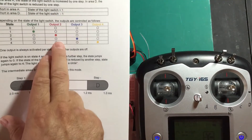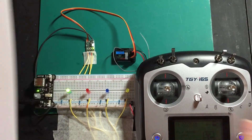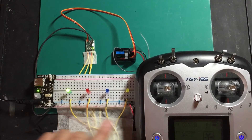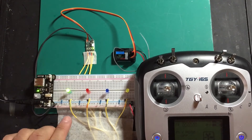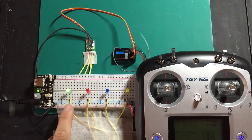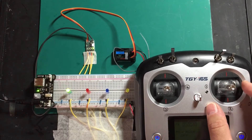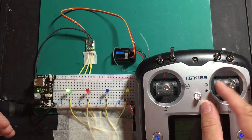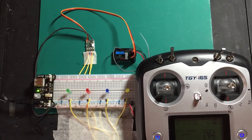As an example: we're in step two, output two — we're in step two, we can go down back to step one. These are LED outputs, but you could use them as negative trigger outputs to trigger other units, whether they be relays or other functions. Maybe not a motor directly, because depending on the load these are limited — I've covered that in the specs video. But certainly you could run this to a relay, like a small triggering nine-volt relay, which could then trigger a much higher output. For example, you could use it to send your tip-of-bed up, and another output sends it down, with maybe the other outputs for something else. That's how you program it — I'm going through explaining each of the modes and how they work.